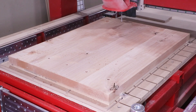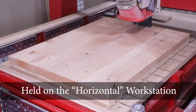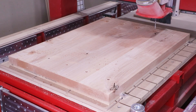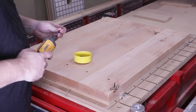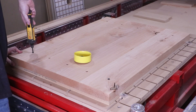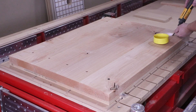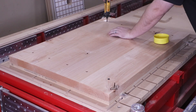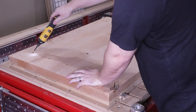I pocketed and drilled a hole pattern that I could use to bolt down this panel directly to a fixture plate being held on the vertical workstation using Legacy's low-pro clamps. I used the CNC to also pocket the hole pattern in the fixture plate and installed brass inserts into all 10 of those holes. Now I can easily align the panel and flip it over, bolting it to the same hole pattern for both sides — freely cutting all edges without risk of hitting any fixtures, surfacing both sides to a perfect thickness and cutting all the details.